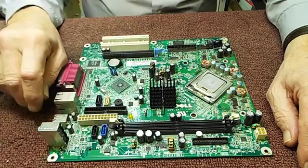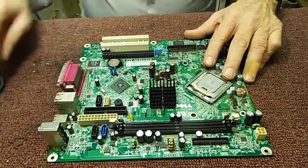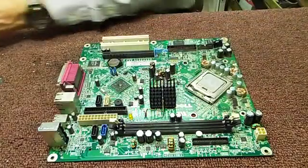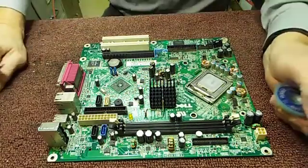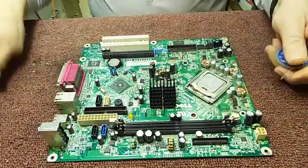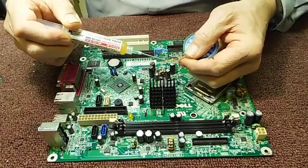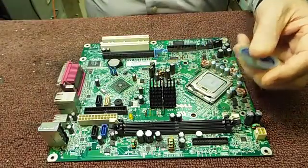So we're going to take a look. The first way we're going to try is with Solder Wick — good stuff. This has been around for eons and it works well in many situations. The trick with it is to make sure that you put some flux on there so that you've got something to work with.